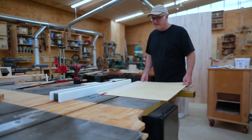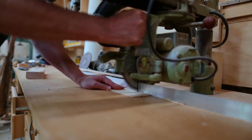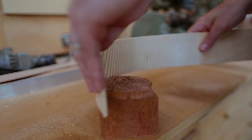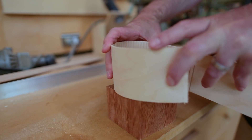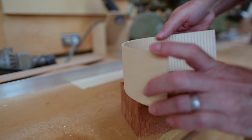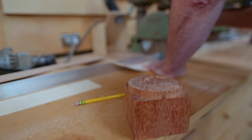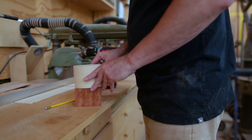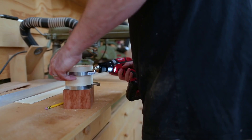I needed to make a container to hold the resin as it's poured over the surface. I cut a circle at the edge of the terrain model and wrapped a piece of plywood around that circle to hold it in place, making a cylinder to fill with resin. I cut a bunch of relief cuts in the plywood so it would bend, figured out the length, and clamped it in place. I was thinking I'd use glue, but the clamps actually hold it well enough.